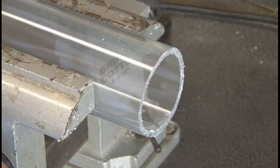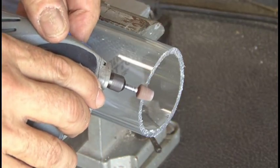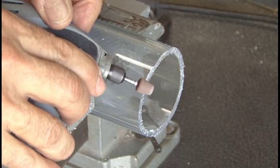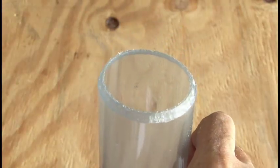Our barrel will be a 36-inch piece of 2-inch diameter, and the edges of that need to be tapered. I use my Dremel and a grinding wheel just to grind down the edge so it's kind of sharp on the end and it'll cut through a potato.